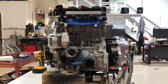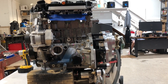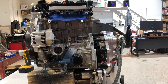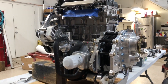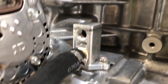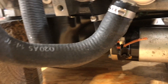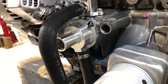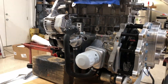It's time to start on the side profile. We've got thermostat work to do, a liquid-to-liquid oil cooler to mount, and we've already prepped for the oil pressure transducer — tapped and ready. We need to get an air cleaner and intake manifold mounted. This side is now done: coolant hose to the oil cooler, coolant hose from the oil cooler back to the thermostat housing, thermostat housing mounted, and the block prepped for the oil pressure sensor.